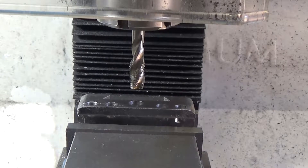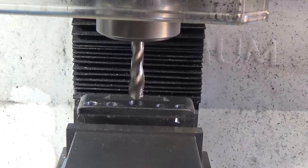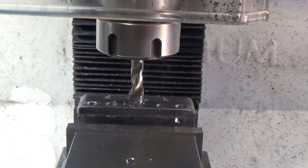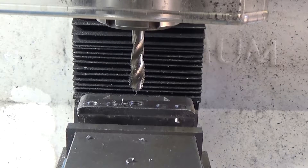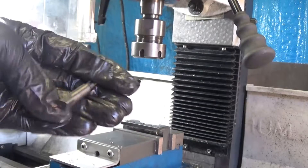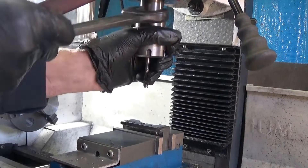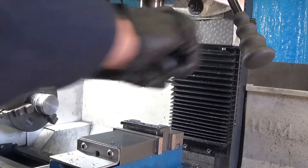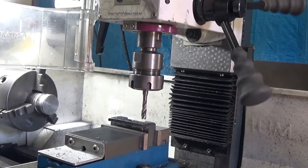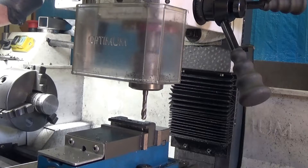Now I reckon this process is magic - I've got the mill set to low range slow speed and just pushing down and it taps right down into the bottom of the thread, then I reverse and it screws back out again. It's really magic, I love it. I'm using these spiral taps and they are really good - they even work brilliantly if you're tapping by hand. They have a very small taper so they can be used as a bottoming thread tap, but even with the small taper you can start them by hand if necessary.